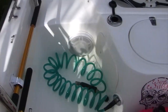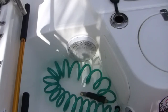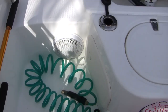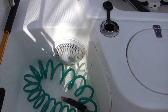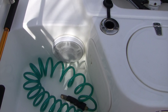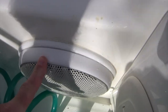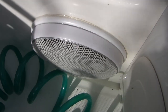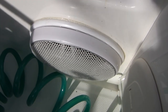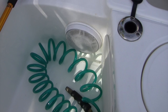One of the bigger projects on this boat was putting the speakers in the back. A lot of boats house the speaker right in the console, but we wanted to keep as much space for storage in the console, so we chose to route the wires for the stereo speakers into the back of the boat. We used the existing port in the starboard location for one speaker, just enlarged it, and then created another marine board custom-fit trim piece in half-inch marine board. The speaker is seated on that with simple clear bathroom caulk from Home Depot, which lets us access that compartment easily and replace speakers as needed. This is our second pair of speakers in a couple of years — they do get pretty grimy with blood and general use.